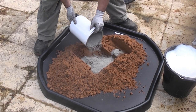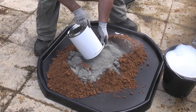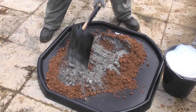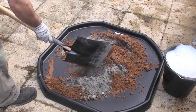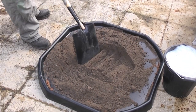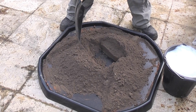If you're doing this in a confined space you should really wear a dust mask. Now we can mix the sand and cement together. Once you've got it mixed to a uniform colour, you can then make an indentation in the middle to add the water.